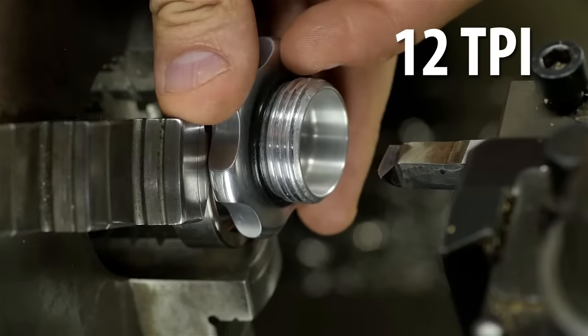There are two ways you could do this. First, you could take apart your lathe's headstock and gearbox, count all the gear teeth between the machine spindle and the lead screw, do the math, and keep changing the gears until you get the 12 TPI relationship you want. Alternatively, you could just set your lathe to 12.